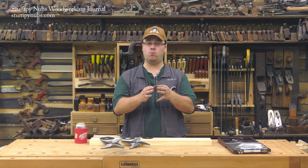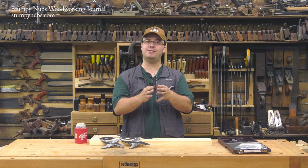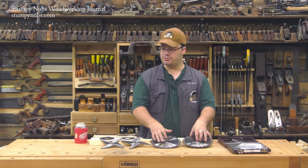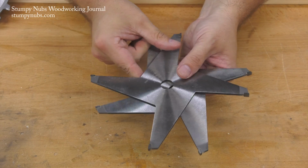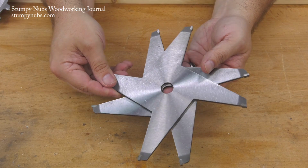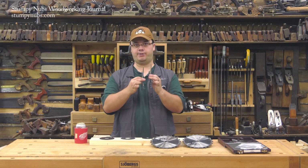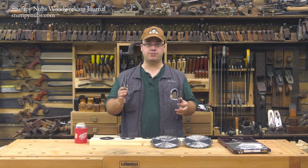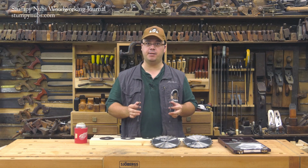If you want to make your cut wider, you have to make the row of rakers in the center wider, and that's where chippers come in. Chippers can be layered between your outer teeth to give you a wider row of flat ground raker teeth. While the points on the blade sever the outer edges of the cut, these chippers hog out the middle.